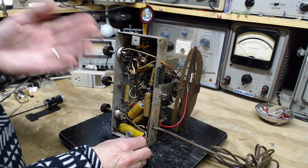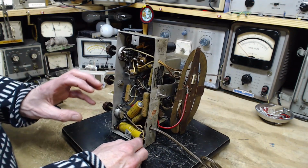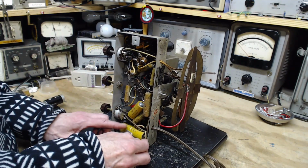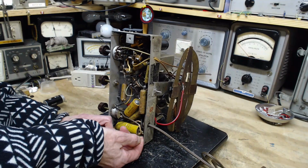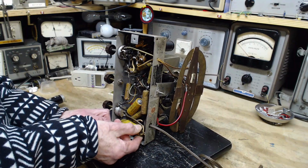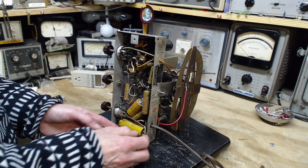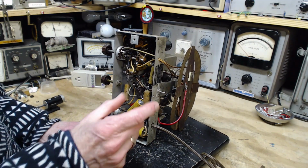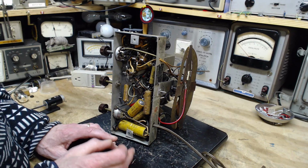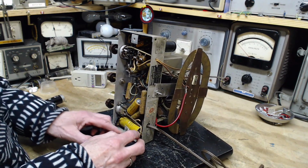So a radio with a field coil usually has small filter capacitors on either side of the field coil, forming a pi filter. And the capacitors are typically 8 or 10 microfarads. They're not really big ones. If you don't use the field coil technique, and instead of a field coil in the power supply, you have a high wattage resistor sitting there. Is that what he's done here? I hope not.